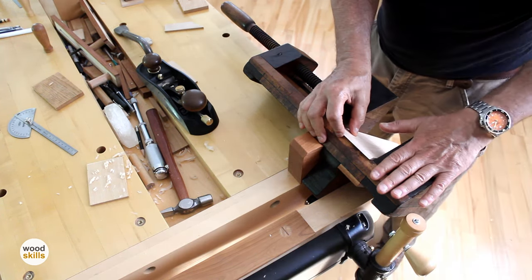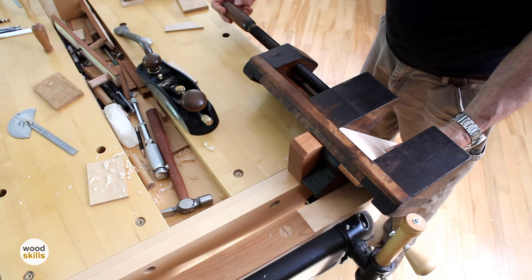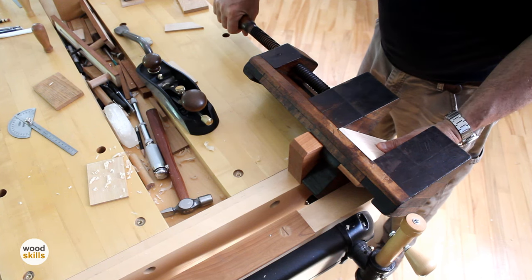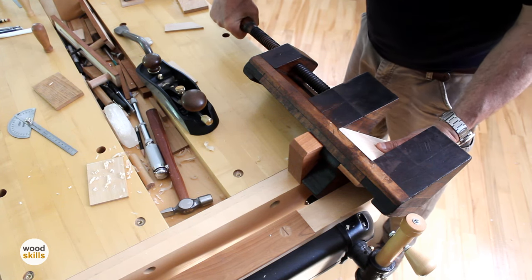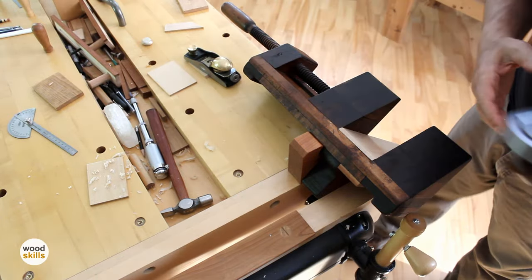And this is the smaller of the two miter jacks. It doesn't have the Acme screw, but it actually works. It's a lot smoother for some strange reason. It's a little proud, so assuming this is not square, I mean not at 45, not beveled, I'll just work that. Use this guy.